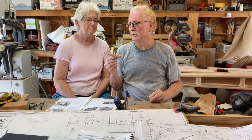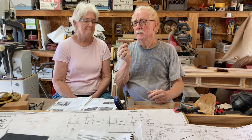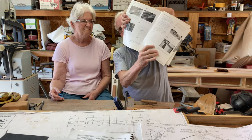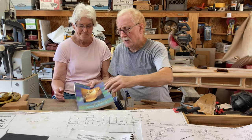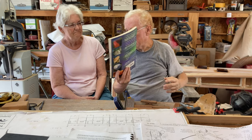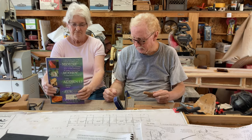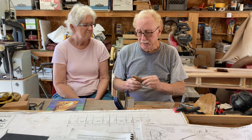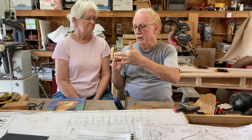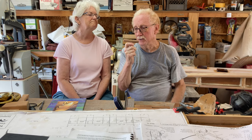After a little hand sanding and rounding over with the router, it came out looking like this — not too bad. I referenced a picture of small cleats for small boats in Ian Oughtred's book on clinker-built boats. He's got suggestions: you can use them as thumb blocks, thumb cleats, jam cleats, or regular cleats. As long as you get the wood grain running end to end, any compression loads will be held and the wood won't split.